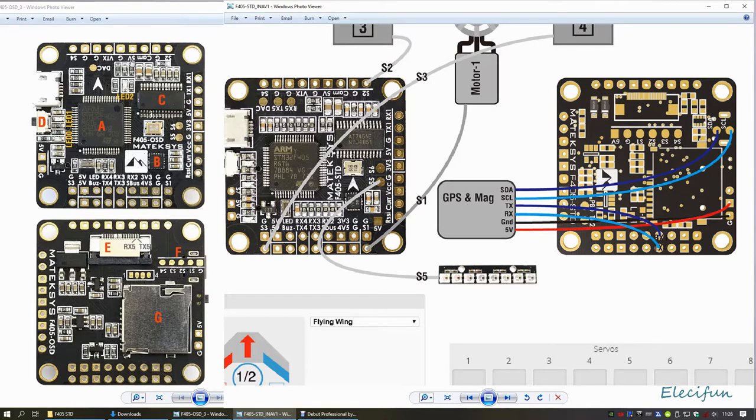As you can see, if you look at these boards, they're very similar anyway. If you look at some of the components, the way they're laid out, it's pretty similar. There are differences, of course, because they are two different boards. But when you look at the connections across the top here and the connections across the top here, they're the same. You've got a little extra connection on this board here because there's an S7, which would tell me that that's a serial connector, but anyway. Down the bottom here, same connections, so connecting up this board isn't going to be too difficult. Everything's going to pretty much go in the same place, apart from these extra connections here for the magnetometer and the satellite receiver. I say satellite receiver because I think there are two or three different types of satellites you can receive in there, so it's not just the GPS, which is the American Global Positioning satellites.